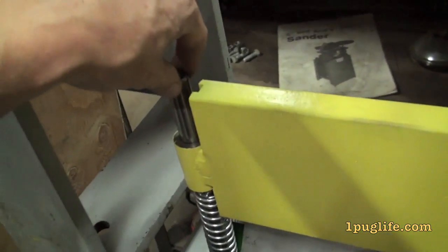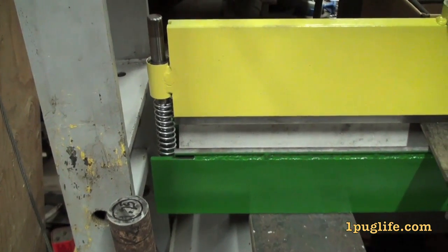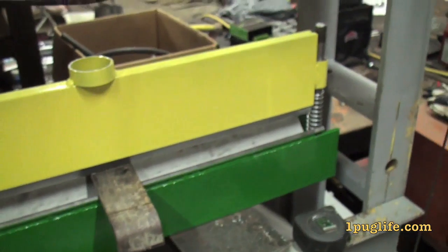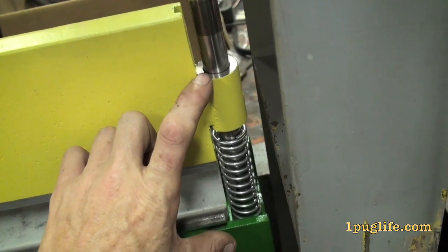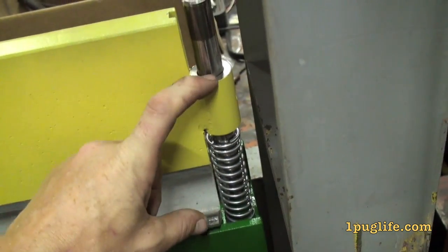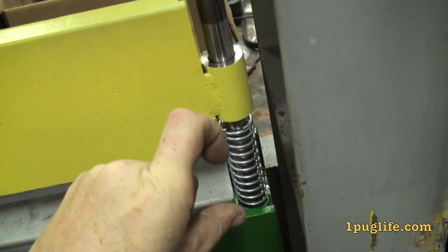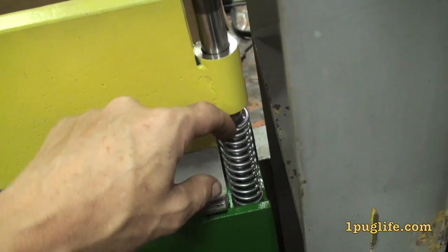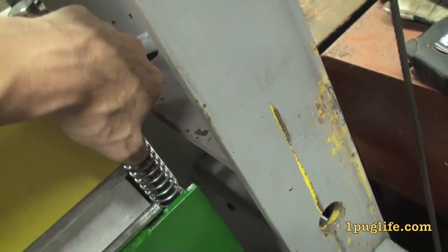But it has to go over a 3/4 inch shaft, 7 or 8 inches long, 6, 7, 8, 9 inches long, whatever. So I measured it out and I figured it out. We need a spring that will be very stiff and be compressible from 7 inches down to 2 1/4 inches. At 2 1/4 inches, that's as much as this one will squish down, and then it takes up all that room because there are too many threads per inch. There's got to be a spring store in Sarnia or London or somewhere. But anyways, boys, that's going to have to be it.